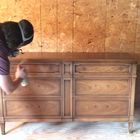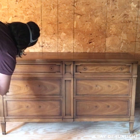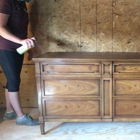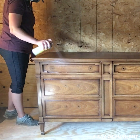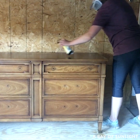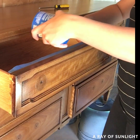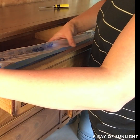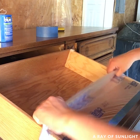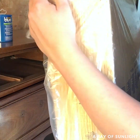All right, so after all the dust was cleaned up, we took the dresser out to the garage and I sprayed it with two coats of clear shellac. Shellac is really strong, so it's really best to just spray it outside. I like to let it dry at least overnight before I paint over it, but it dries within a few minutes usually. So after it was dried to the touch, I taped off the drawers with tape and plastic so I wouldn't get any paint inside the drawers and so I can leave the drawers in when I spray.